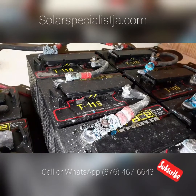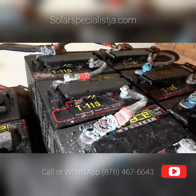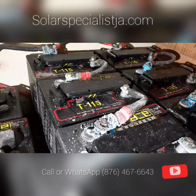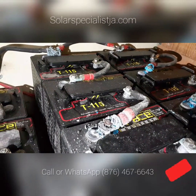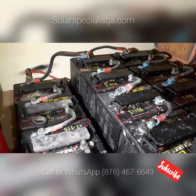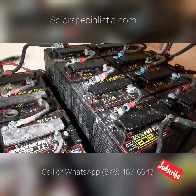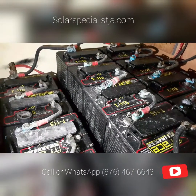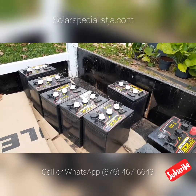What you're looking at is corrosion due to fumes coming from the battery when it charges. Inside the battery is sulfuric acid and water, so when the water boils it creates a fume — basically an invisible steam. However, this fume is highly corrosive due to the sulfuric acid, which is the main reason your room has to be properly ventilated. You need to get rid of the excess hydrogen that builds up when the battery charges, because water is H2O — the H being hydrogen — so when it boils, you are releasing hydrogen into your immediate surroundings. That corrosion is due to the sulfur.